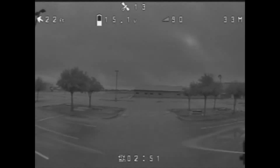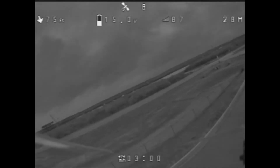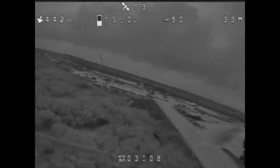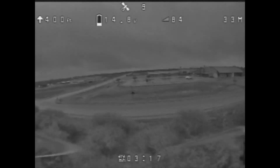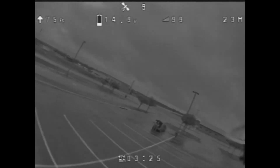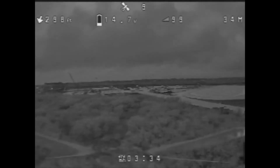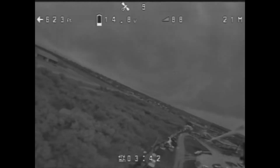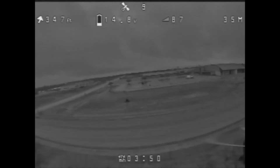This is that night vision quad, and I love this thing. It's like a super stealth quad - get it about 100 feet above the ground and you cannot hear it on the ground. It's amazing. It's a 7-inch quad and it stays in the air forever and a day. I'm out 600 feet on 200 milliwatts with that solder fix, and it works like a champ. So I think we've shown that we can fix these UFL connectors - not actually fix the connector itself, but we can keep a VTX or even a radio receiver going if you rip one of those UFLs off. It is possible to save it so that you don't end up contributing to the landfill.